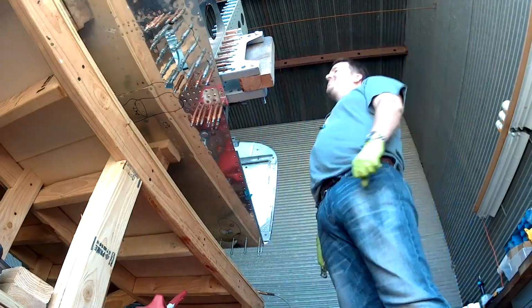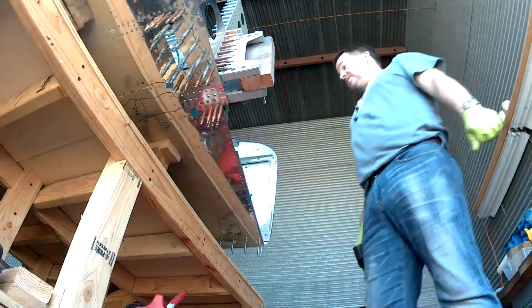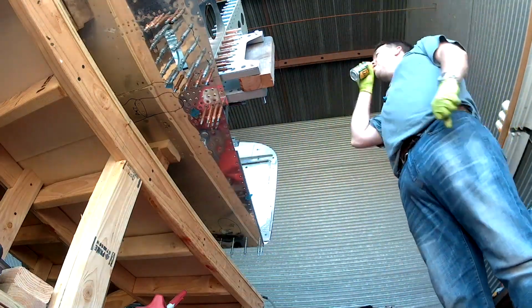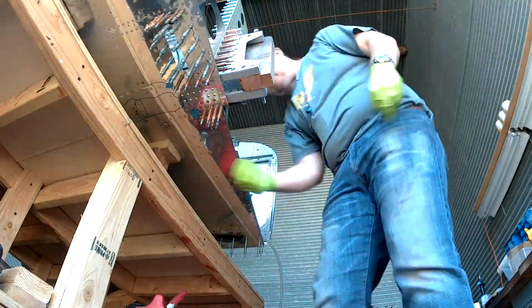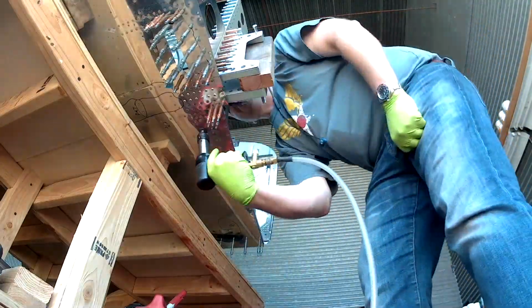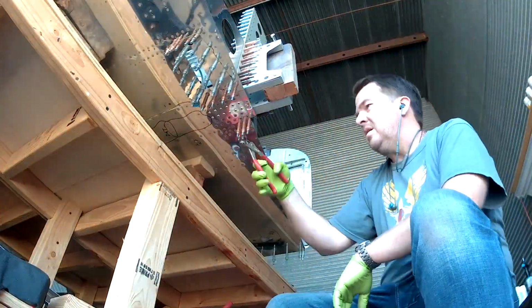Yeah, this is looking pretty good. So there's a bunch of rivets around the landing gear area that I cannot get to, and this is something that Van says. Look, rivet all the rivets you can that don't require moving any bolts or removing any bolts. Do those last. So basically, any rivet that you can get, go ahead and rivet it in. Anything that you can't get, wait, and then do those later. And that's basically, by the end of this video, the point that we've gotten to.